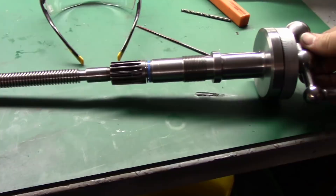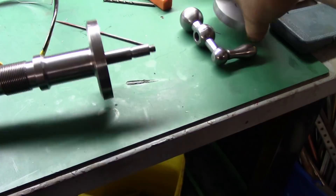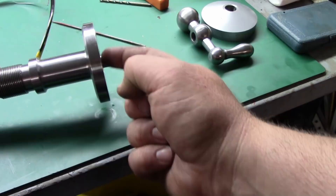There's pretty much our parts stack-up all together. I've got a little bit of play in this, and now we just need to make the little bushing that goes in here — it will be sandwiched between the bearing that rides in this groove and the hand wheel. That will be the subject of the next and last video in this series.